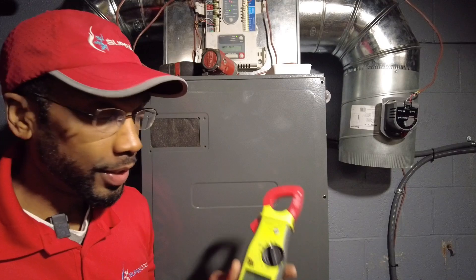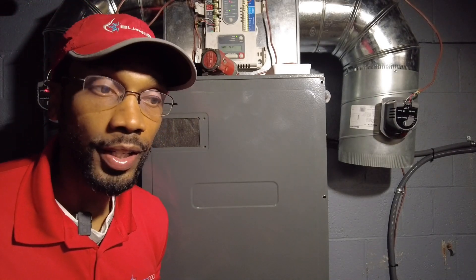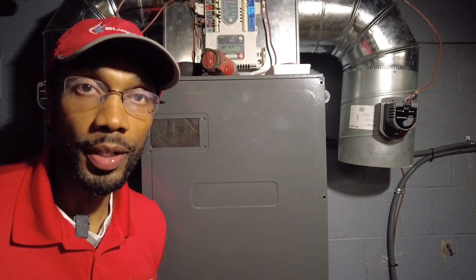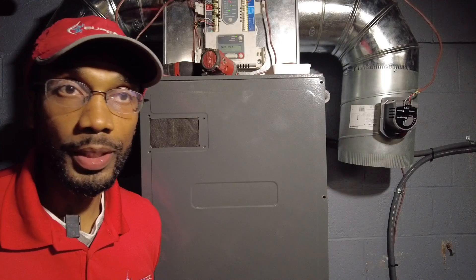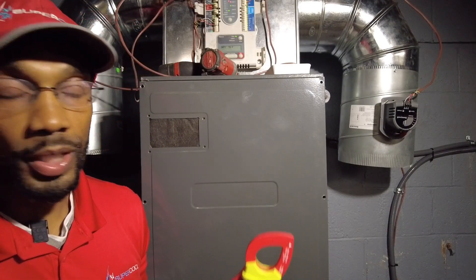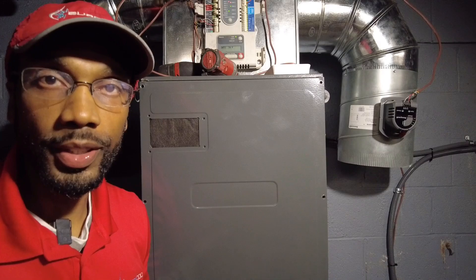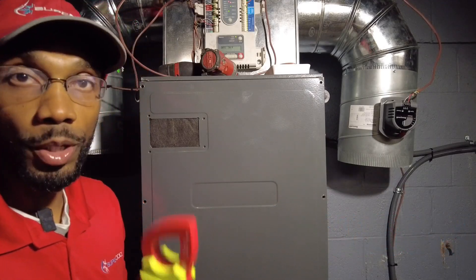That pretty much concludes how to correctly check power and amp draw on the blower motor for a heat pump. You need a meter that can read frequency through the clamps or probes at well below one to two amps, because high-efficiency air handlers — especially with ECM motors — pull very low current. Even compressors are starting to pull really low current relative to their capacity. We want to know true power, not just volts times amps. Check the link in the description — this meter is going for about $299, and you get 10% off with the code TECHKNOWLEDGY — spelled T-E-C-H-K-N-O-W-L-E-D-G-Y. Let me know what you think in the comments. Thanks for watching.